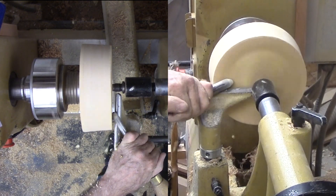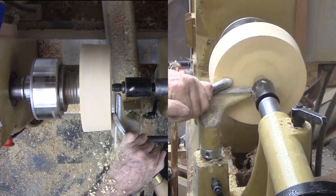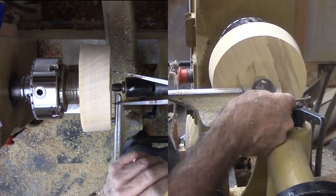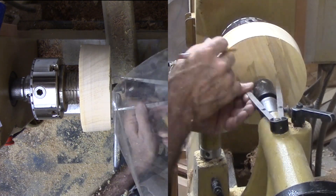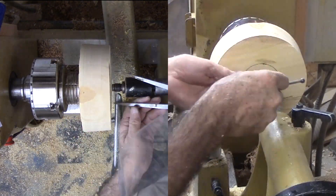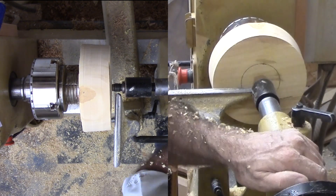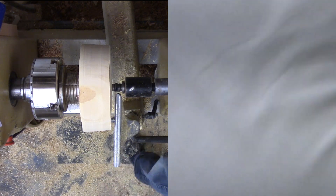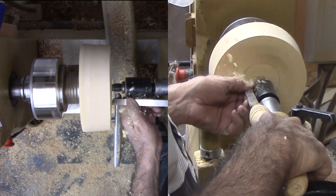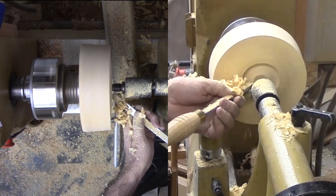Since I already have two good surfaces and a good thickness, I do not want to use a tenon for this bowl. Instead, how about a mortise? I measure for the mortise. By the way, I never touch dividers or calipers to moving wood — I think that is dangerous. With my smaller box scraper, I can form the initial mortise. It is tight against the live center and I cannot cut out the center. The scraper, however, is wide enough to allow the jaws to seat flat, so I do not need to remove the center. This is a temporary mortise into what will be hollowed out for the bowl cavity.